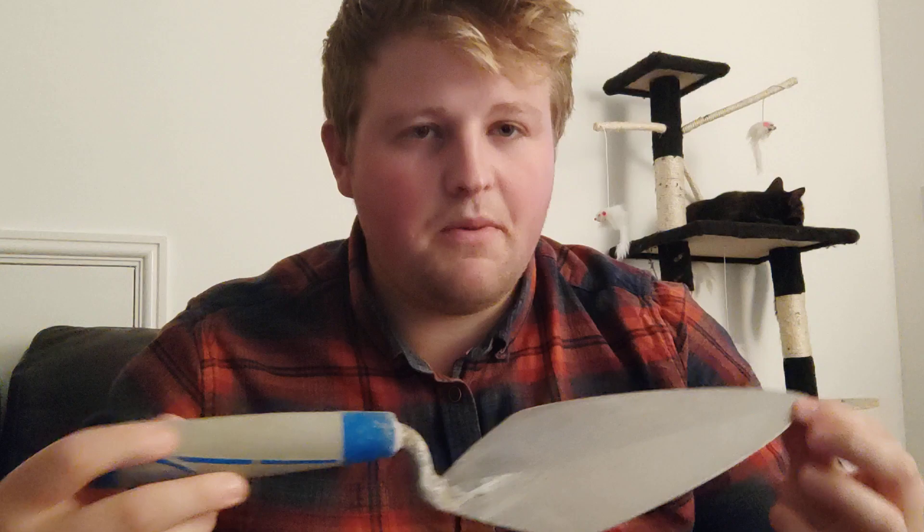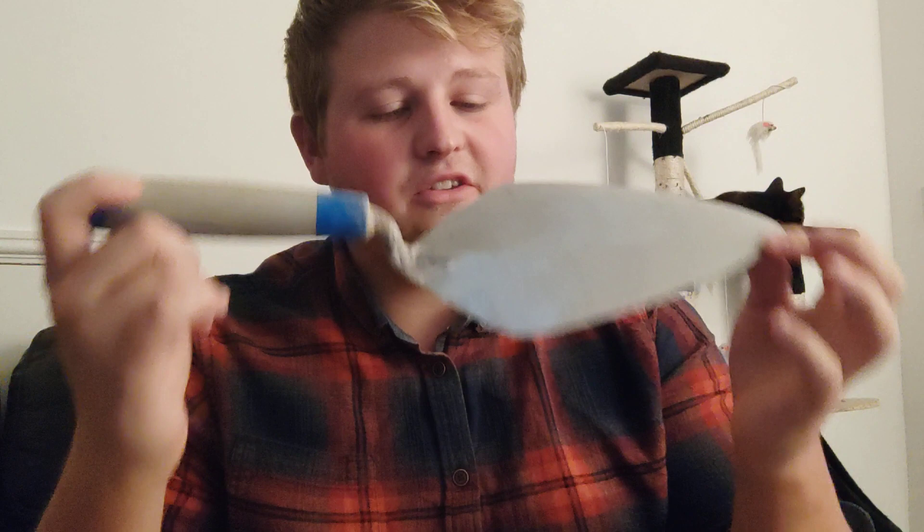With a 10-inch and a 9-inch, which I use now, you pick up only just enough for one 440 block. You can still pick too much if you start layering it on, but that is one of the things I find so good about a smaller trowel when you're learning — even with something like a 9-inch, you get used to picking up just enough that you need. And that's why pick and dip takes a long time to master — you need to pick up enough, not too much, not too little, and find that rhythm every time.